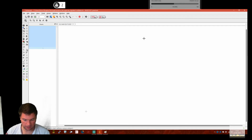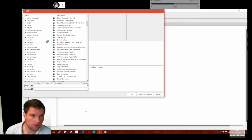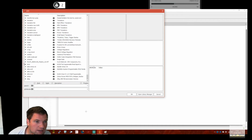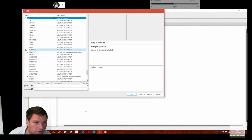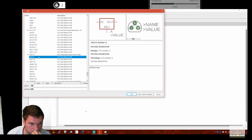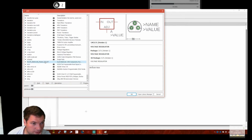I'll tell you what, right? Let's get something on a page. Let's at least get some designing done, and then we can come back in and we'll put a placeholder in for a voltage. We could use an LM317 and then just control it with a digitally controllable variable resistor. That's probably not a bad shape. A bit more complicated, but I can stick a little Arduino on the board.